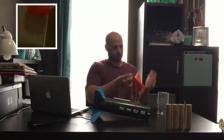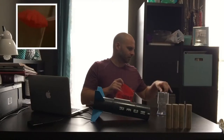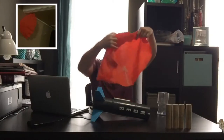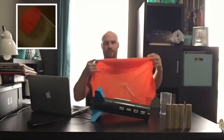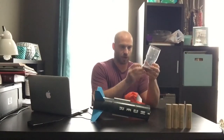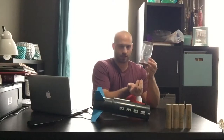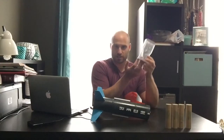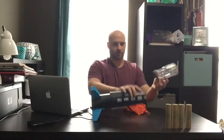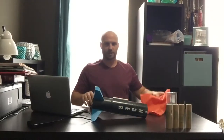The first stage carries the largest parachute of the entire rocket. Including the drogue chute for the command module, there are five parachutes total, and this one is about two feet in diameter. Since the piston opening is upside down, gravity wants to open the hatch, but stopping pins keep it shut. Once the ejection exhaust gas pushes the piston out completely from the first stage, it has room to open up and deploy the chute. That's the first stage — moving on to the second stage.